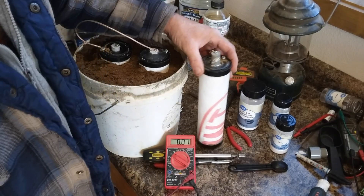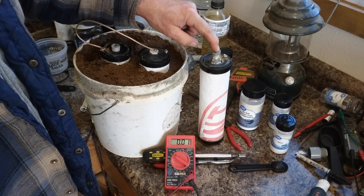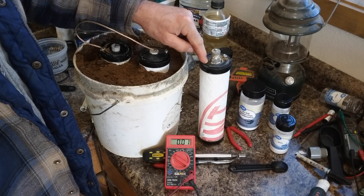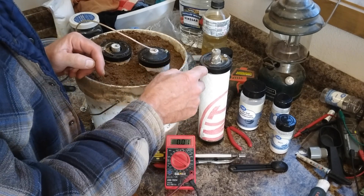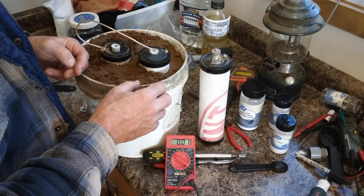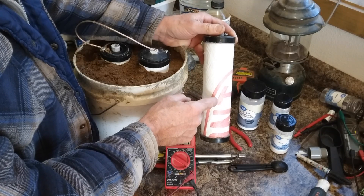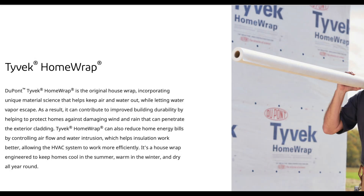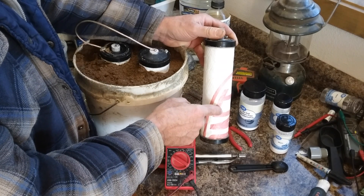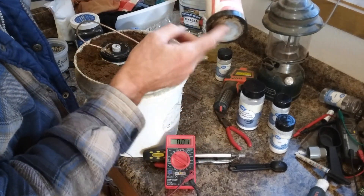I went to building individual cells and wrapping them with this building material. The smaller cells have the same electrode material as the earth battery — the same magnesium rod covered in alum and the same type of carbon block water filter. In between the magnesium and the filter on the inside, I have a filler material mixed with an electrolyte. Each one has a different filler right now because I'm still experimenting. This membrane material is called Tyvek — it's a house wrap material you put on the exterior of your house so it allows your house to breathe. It repels water but allows water vapor to pass through, and this is what keeps the cells electrically insulated from each other. I've got the bottom sealed up too.